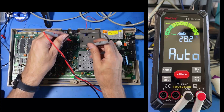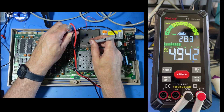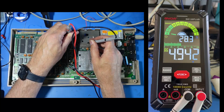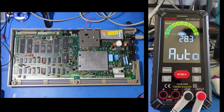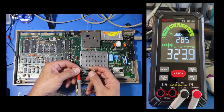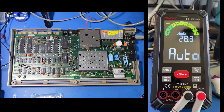Next we're going to check for 5 volt DC on this chip here — and we have 4.9 volts. This is really good the way it switches for you; you don't need to decide anything. Now we can also measure resistors. Grab this 330 ohm resistor and just put it across the legs — look at that, 323 ohms! That is absolutely brilliant. Again I didn't have to touch the meter; it just recognised it and read it. I'm really impressed — it's going to save me a lot of time, and for a beginner it's absolutely brilliant. Just keep it in auto and it will read and do everything you need.